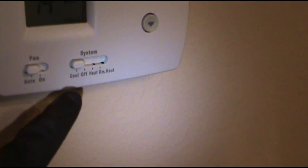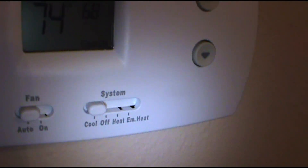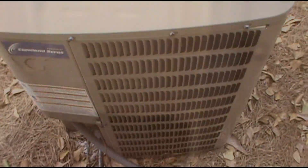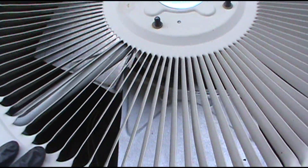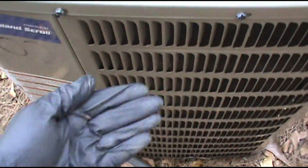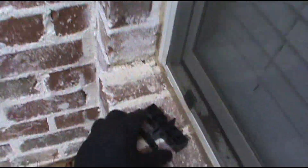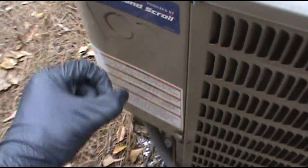Filter's good. In heat mode I'm going to go outside and see what's going on — again I'm the one who put it in cool just to check the refrigerant levels, because when the refrigerant level is low it'll get close but it won't shut off when it gets to a set temperature. When I came out here I heard it buzzing — nothing was turning, the fan wasn't turning, and the compressor sounded like it was trying to fire up but just making a buzzing noise. I went ahead and pulled the disconnect. I think we're going to have a bad capacitor — we'll take the cover off and check.